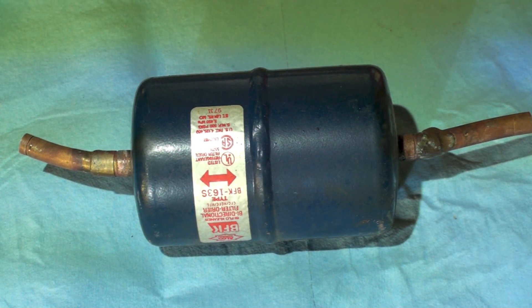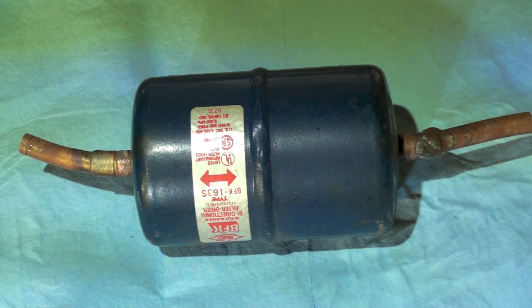You might notice they were going to use the good dryer — the reversible dryer — on a non-reversing line. That's the discharge line; it only goes one way. So a lot of mistakes were made here. It still runs, which is kind of amazing, but it does. That's the dryer in the discharge, and he used a good one too.